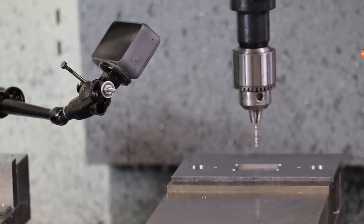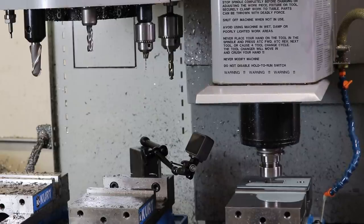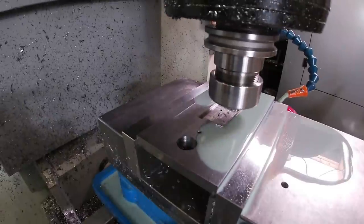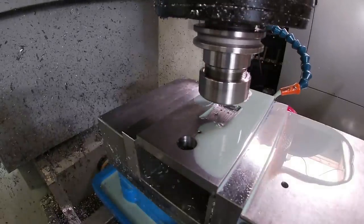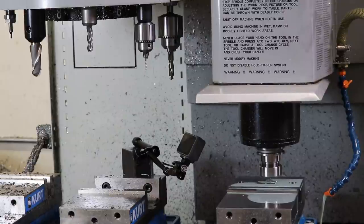Okay, we're set up over on the Haas mill to finish the stripper plate profile. So this is going to drill the through holes for the mold features, the mold cavities themselves, and rough out the shape of the two mold cavities and then do the final 3D raster profile cutting in a kind of crosshatch pattern. We can speed up the process here. So right now we're center drilling all the little pilot holes for the snouts of our plastic parts. So I'm roughing out a lot of the steel with just drilled holes, and then we're going to come back with the micro machining with a 1/16 end mill to 3D profile everything.